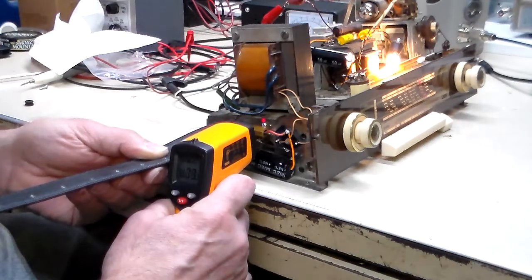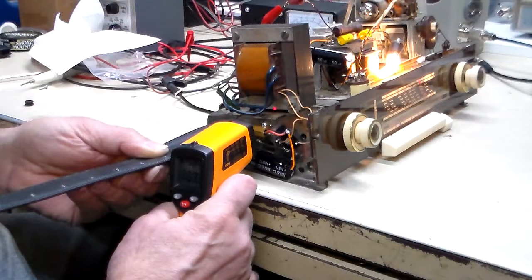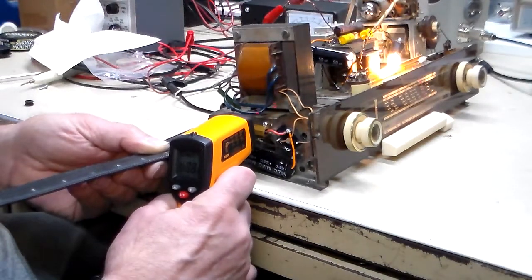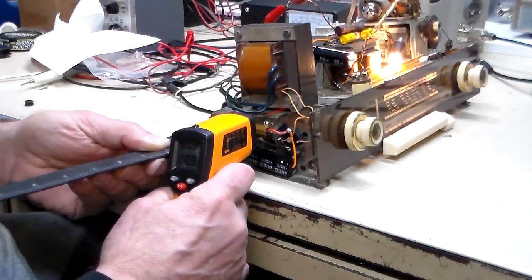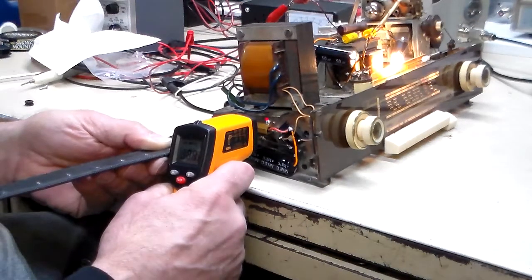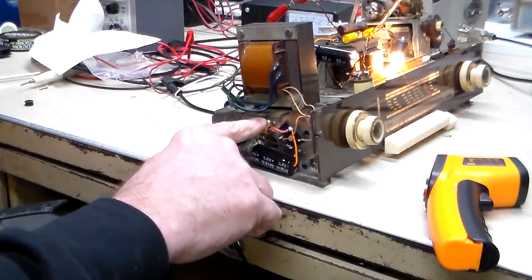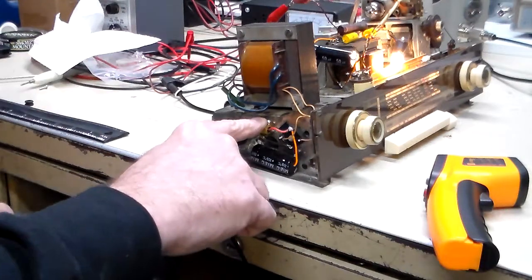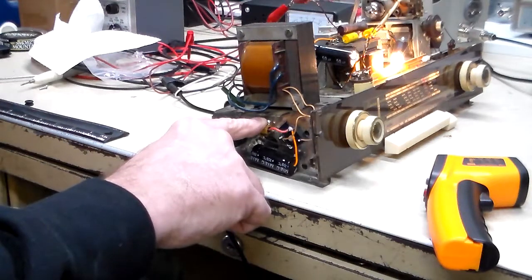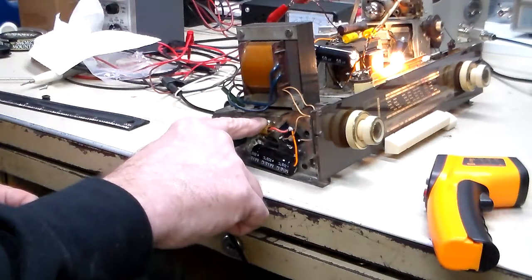94, 95, 98, 102, 103, 105, 106, 107. I don't know at what point I'm hitting the bottom of the transformer, but that's not really that warm. I'd say around 107 is probably about the peak — looks like 108 and then it drops down drastically. I can definitely feel it's getting very warm, not hot — very warm. I mean, I can keep my hand here all day long. So definitely bolting it into the case takes away any excess heat — and that's probably what gives it the 10 watt rating.